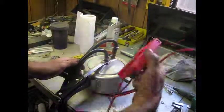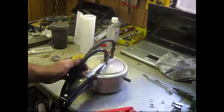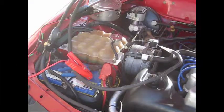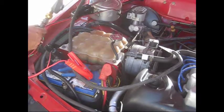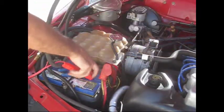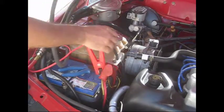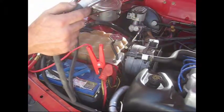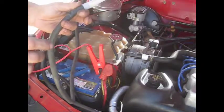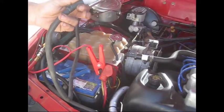Connect the terminals and you're ready to go. Connect the airline. Connect the battery. And there comes the smoke — it's working pretty well. Here it is actually working. I've got a latex glove over the end of the throttle body, and it looks like it's coming out pretty much where the throttle body joins the manifold. So that's how useful this thing is.